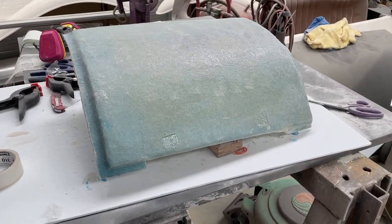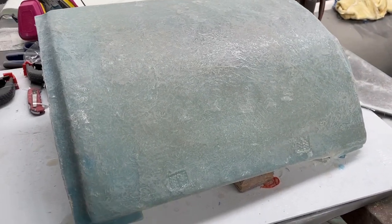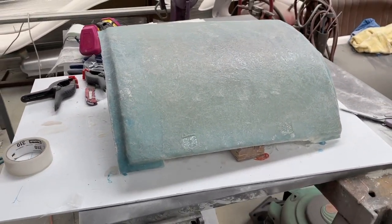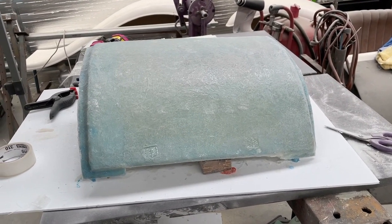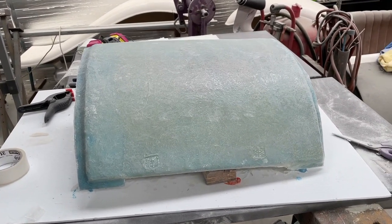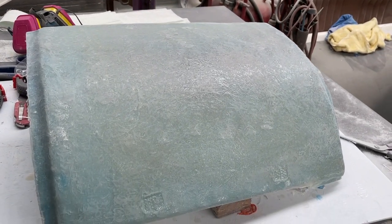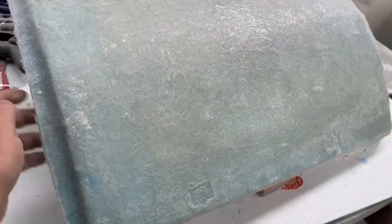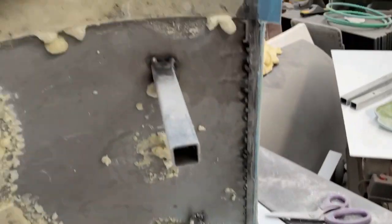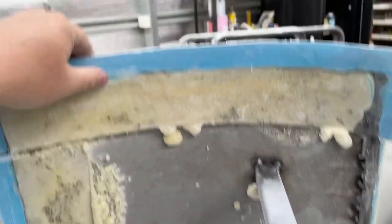Okay. Next on the demold list is this guy. I attempted to fix the first one I did with epoxy. Silly me didn't clean all the wax and PVA out of it before I put the epoxy on. And it just went nuts. So I remoulded it, I put flanges underneath just with that clear plastic stuff, and I stuck them on there with expanding foam, construction foam.